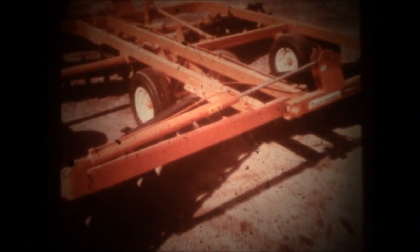There are two 3-inch hydraulic rams to lift and lower the frame, applying smooth, uniform pressure at both lift points. This patented lift bracket allows each wing section to float up to 10 degrees, holding uniform depth setting in the low spots and over the ridges. And the 2-inch hinge pins have extra strength to carry the workload and lift pressure.